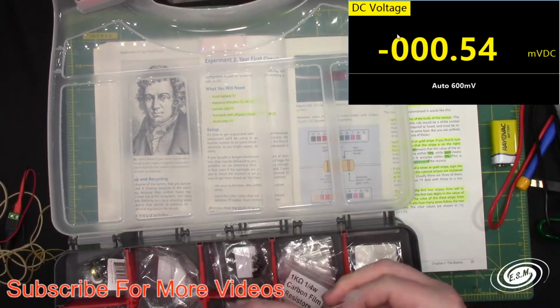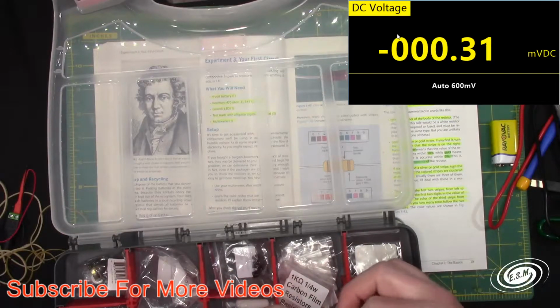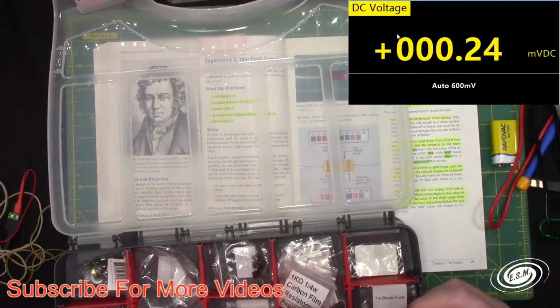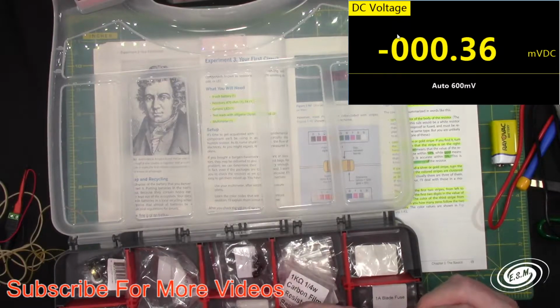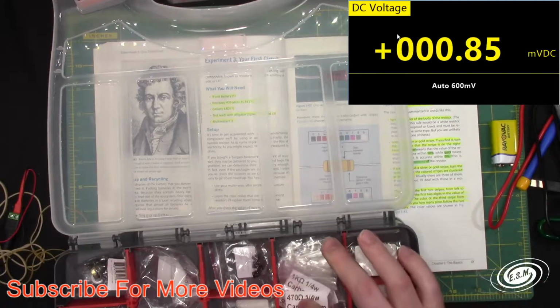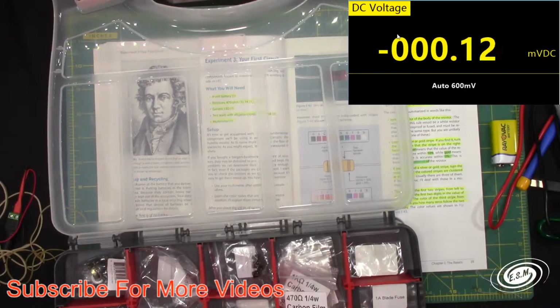And we're going to hook it up just like they tell us to hook it up, because we're going to be crazy following the book. And this one is yellow, purple, brown, and yellow is 4. Purple is 7, or they call it violet on my card. 4, 7, and then brown is 10, so 470. So we have that. It all checks out. You don't always trust what it's labeled. And then we need a generic LED.